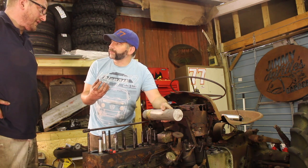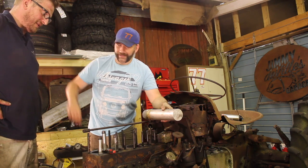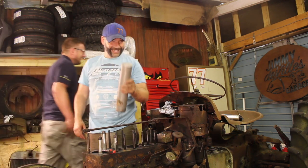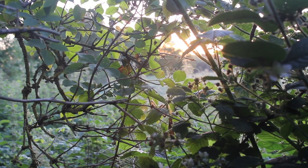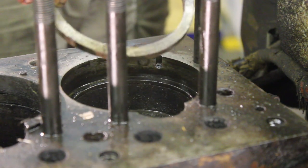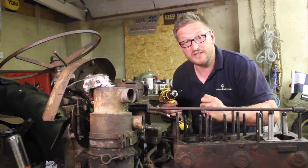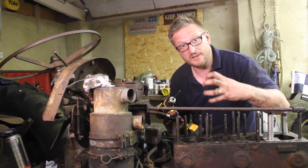Second cuff ring out. Right, so what we're going to do now is chain drill a ring of holes in the top of the piston, punch out the centre so we can actually see into the piston, and hopefully separate the piston from the conrod.